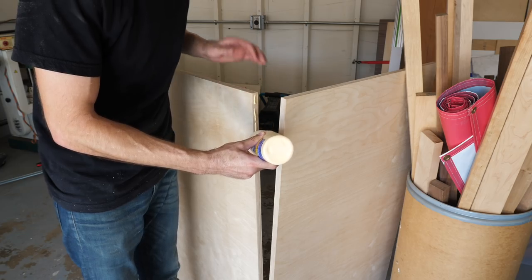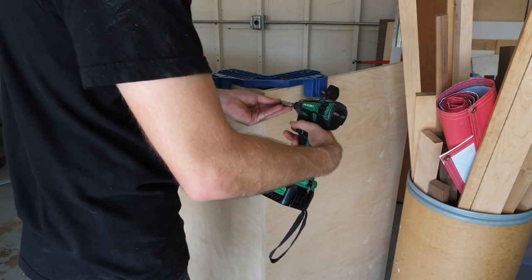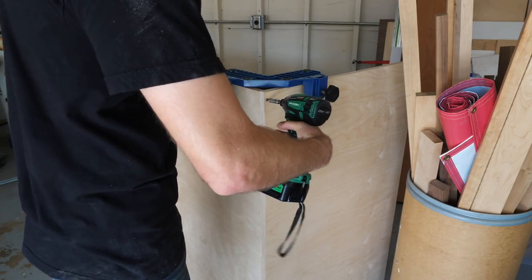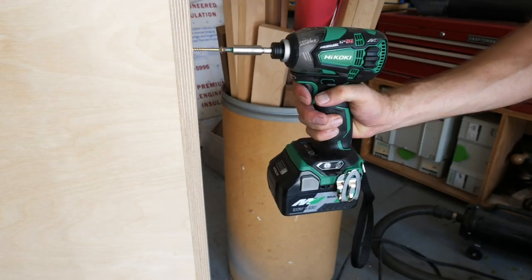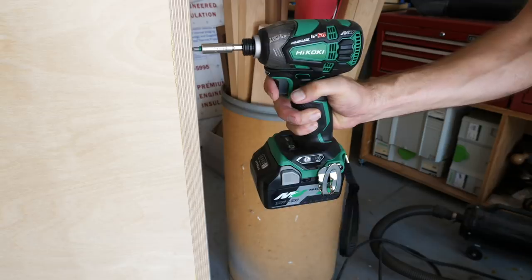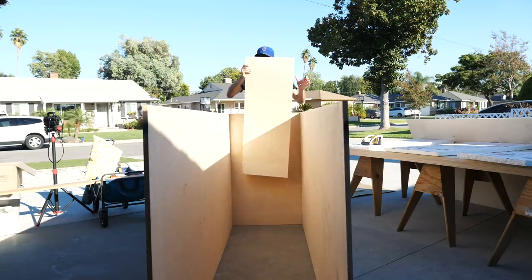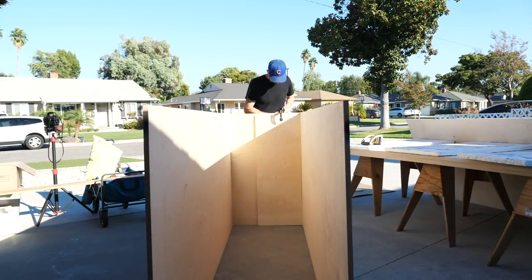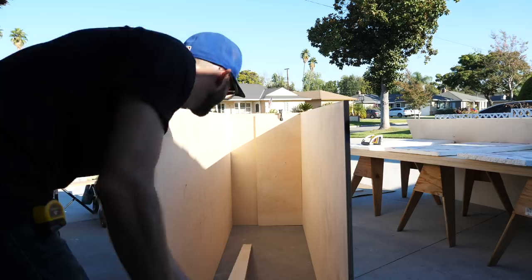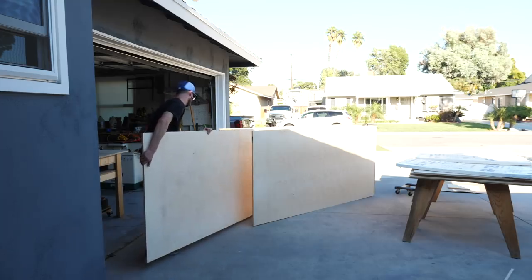Back in the real world I started putting everything together with glue and screws. I used these Rockler corner clamps to help me keep everything square and as an extra set of hands. Here in the back of this shot you can see the bucket of ignored scraps I was just talking about. It was starting to get a little cramped in the garage, so I moved everything out to the driveway before it got too heavy, then started working on the center partition. I clamped in a piece that will become one of the shelves as a spacer to make sure the partition is exactly where it needs to be, then glued and screwed it into place.